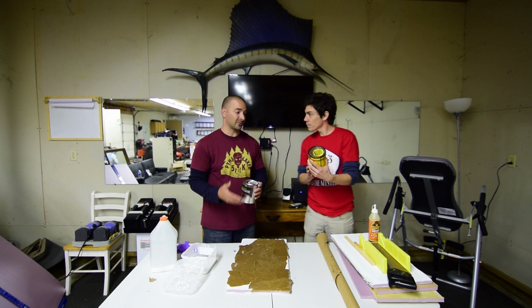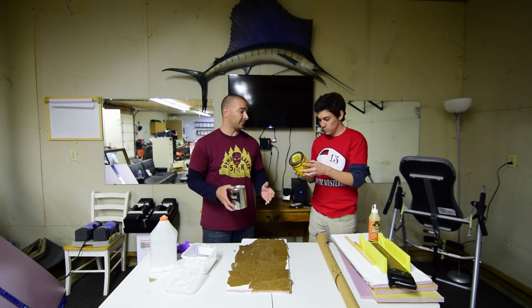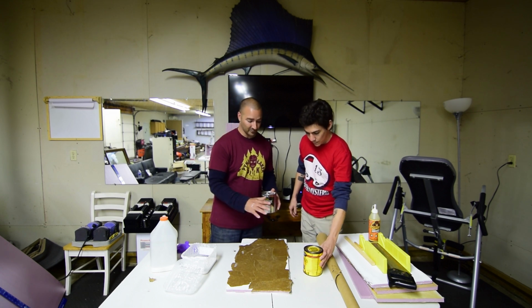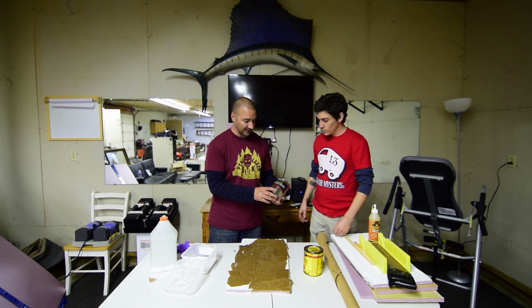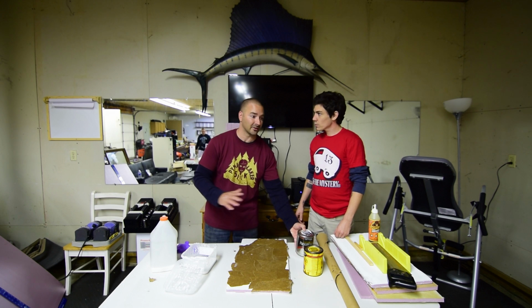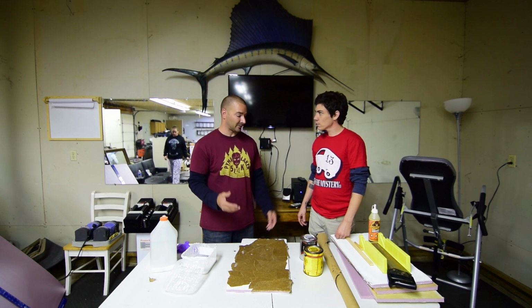And that's oil-based. That can be water-based or oil-based. I've only used oil-based, so that's the only thing I could speak to. I don't know how well the water-based stains would work. But I've stuck with the oil-based, and we've done different shades, and then I just use a clear gloss, fast-drying polyurethane. I've also done the wipe-on poly, and that's worked really well too. But I'll do several coats until I'm happy with the gloss.